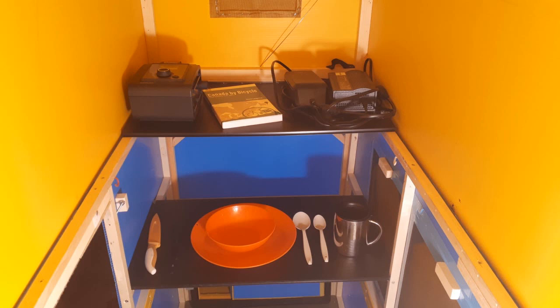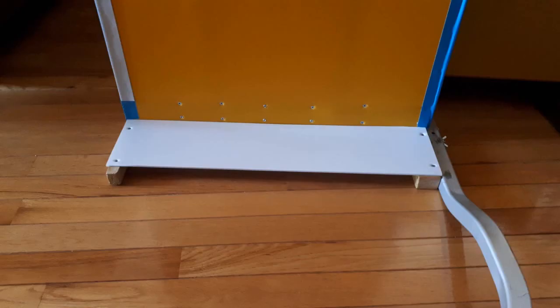One very easy-to-make feature that I like about the camper is that I can add shelves for storage or to use as a table when bad weather forces me to eat indoors. Since I had plenty of 10mm thick coroplast left over after making my platform door, I made new shelves out of this material — it's 20% lighter than quarter-inch plywood. Finally, here is the splash preventer: a piece of coroplast screwed to the top of the two hood descent delimiters, serving to keep the inside of the hood dry when traveling on wet roads.